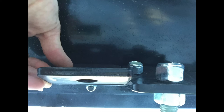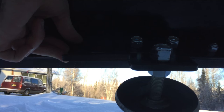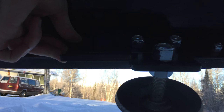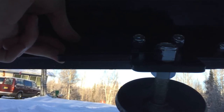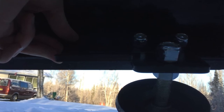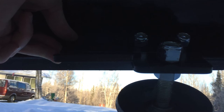And the problem now is that as the snowplow travels across, my skid shoes have a tip on the end of them and they're kind of pointed into the ground. So I'm going to need to get the other one so that that point is closer to 90 degrees off of the ground so that I won't be digging in as I'm driving. It will be skidding across the top more.